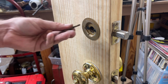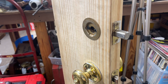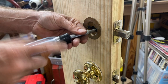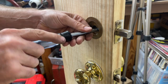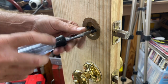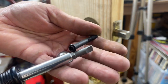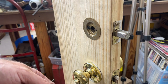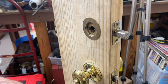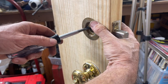And these screws actually screw into a hollow screw that also introduced us in the Kwikset world to needing a bigger flathead. So I have repeatedly mentioned that it's good to have a 3/16 or 5/32 flathead that will accomplish most locksmith tasks. Kwikset screws and old Corbin Russwin use these same things, old Corbin Russwin deadbolts, and even new ones. Nowadays, you'll run across, even here's an example right here, we're still seeing those on all heavier duty Kwikset Titan, whatever, deadbolts. They still use this same system.